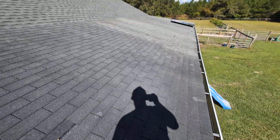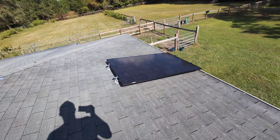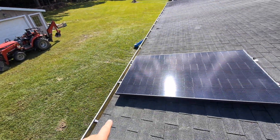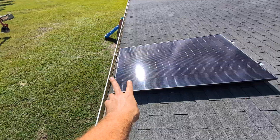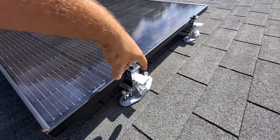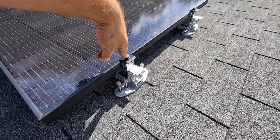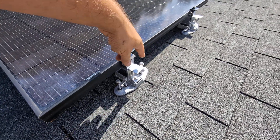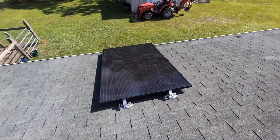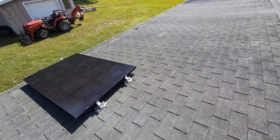Here we are on the roof side. I already put two panels up and was doing some spacing, seeing how I'd operationalize this process. This set will go relatively close to the edge, and I'll probably use the edge clamp in the future. The top-speed snap-and-rack mount makes things a lot easier, even though it puts a lot of penetrations. As long as you use the MP1 or M1 caulking roof sealant they require, you're not going to get leaks — just do it right.